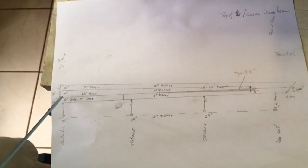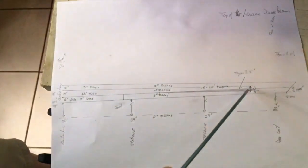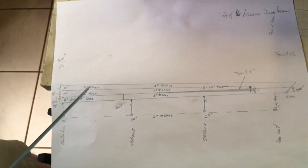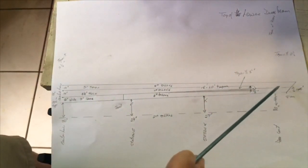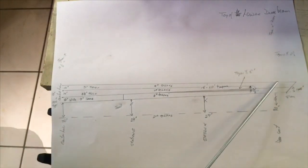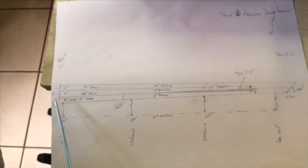The second strake is 14 inches and 4 and a half inches thick, ending at center, with a thickness here of 5 inches. The third strake, which is number 8, is exactly as number 6 — 12 by 3 — and again I have it tapering down to 10 inches, so we should have 20 inches at the front of the stem. We're also reducing the thickness down to 2 and a half inches both at the front and at the stern.